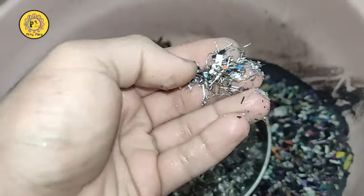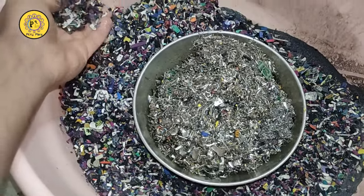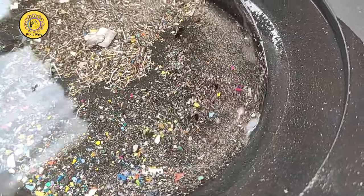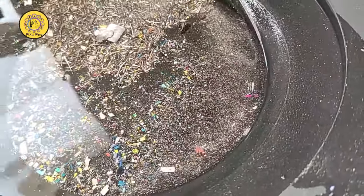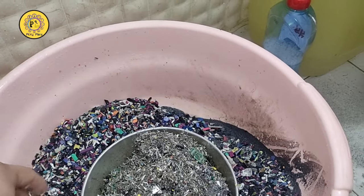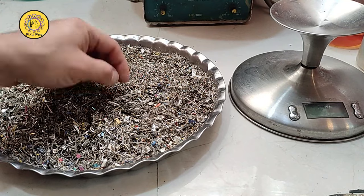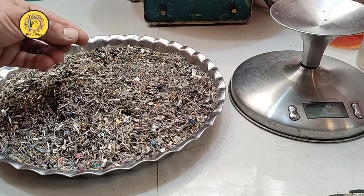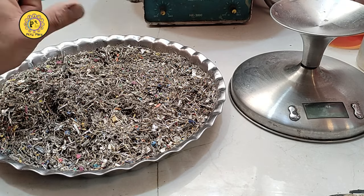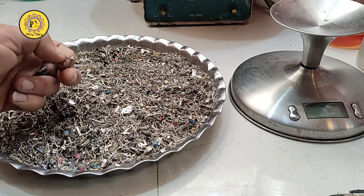Actually, this is a shame — such low-grade pins, not worth the time and chemicals. But I'm really curious to find out how the gold yield is, so let's find out. I did my best preventing gold flakes coming off in the milling process, but some came off. I'm going to add this to the same batch to be processed with the pins. Some of the plastic still contained pins, which I intended to process separately. After grinding and separating through gravity separation using a pan, this is what I've got — almost all pins, but still some pieces of other metals from the computer port casing. I tried to remove as much of the magnetic materials as possible after panning.